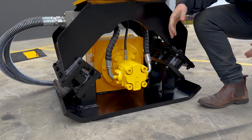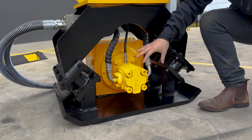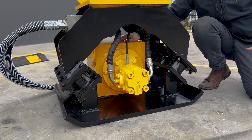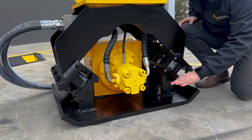They're very simple, going to consist of an inline, an outline, and also our relief line here. You don't have to touch any of this — the motor is going to run through a shaft and into your counterweight here. The counterweight is going to spin, creating the vibration that's then transferred into the plate, allowing you to compact that material.